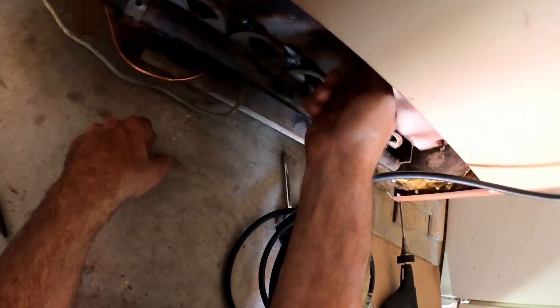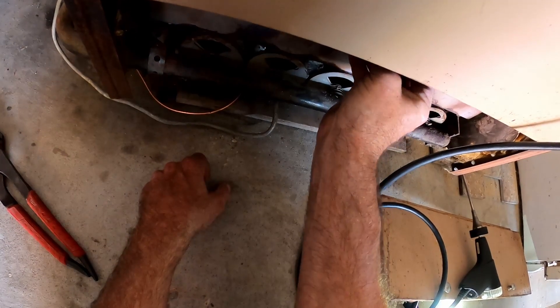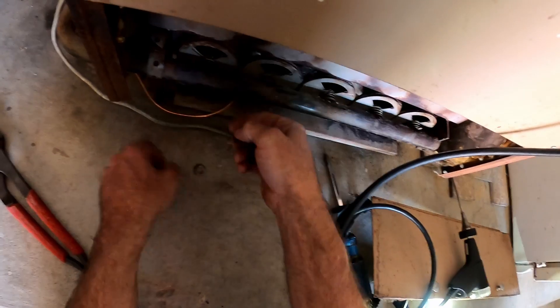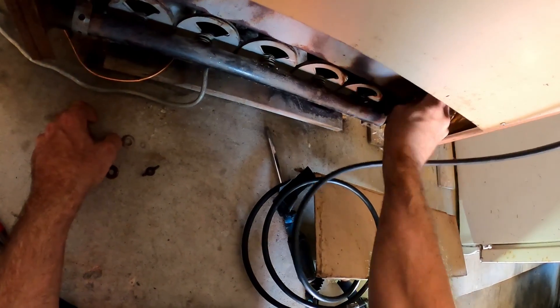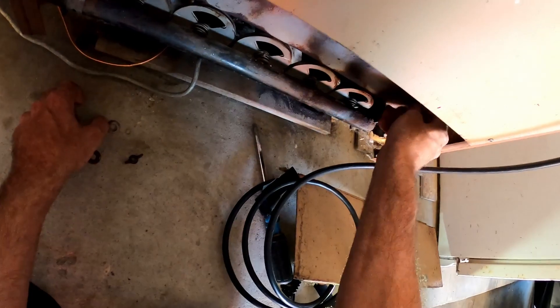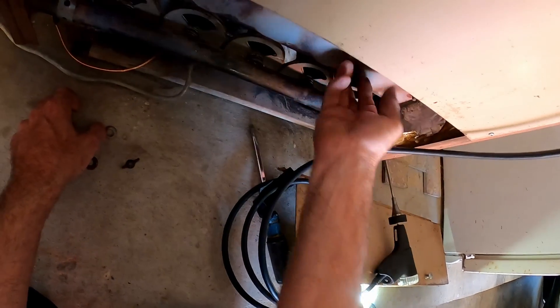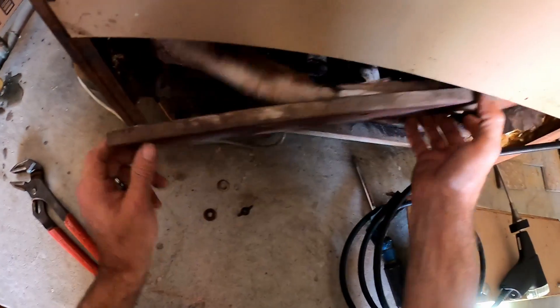Because this thing is from the 60s, I need to find out why I'm getting that high CO. The heat exchanger could be plugged at the same time — I don't know. Oh yeah — holy crap. Might be asbestos. The boiler is done.